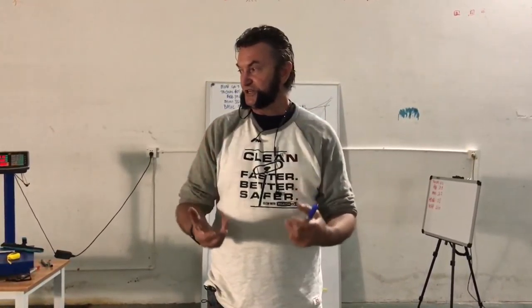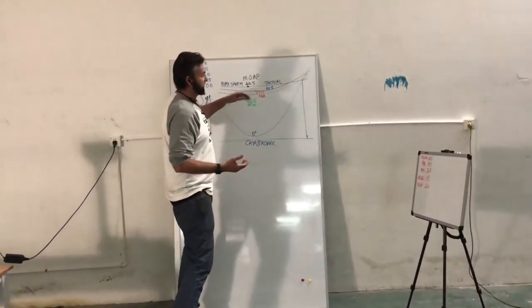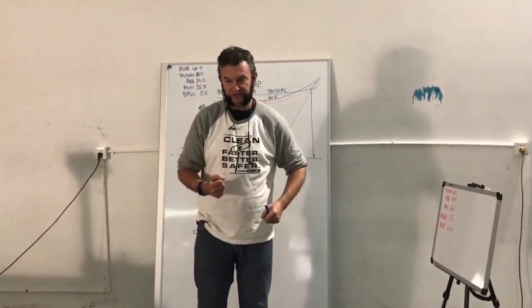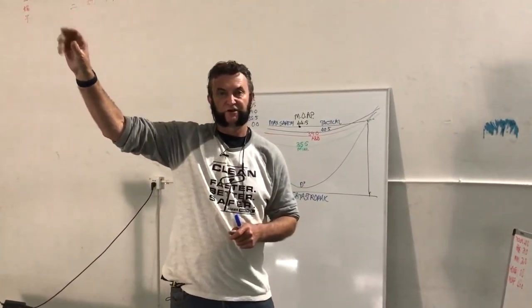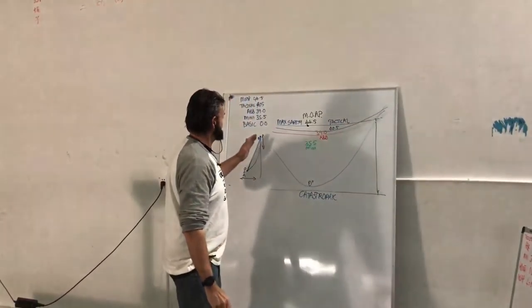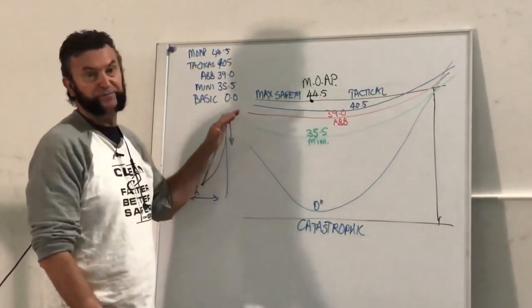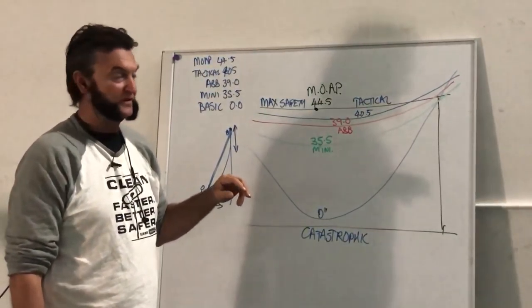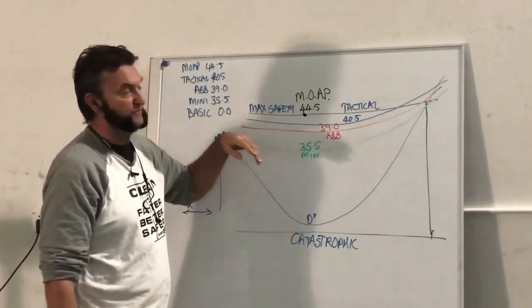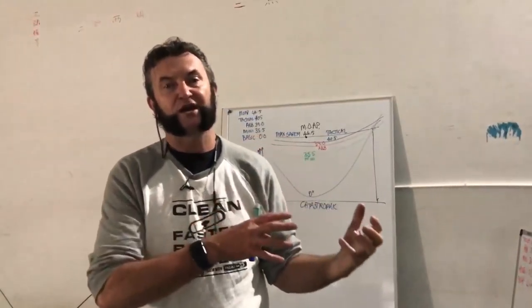So the rigidity of a pole from an efficiency point of view is all about what did I do with my body and how much of that ended up on the glass, right? So if I've got a rigid pole, when I move, the brush is moving. If I've got a floppy pole, when I move, the pole is moving, yeah? So it's critical for professional use that you have as rigid a pole as is practical.